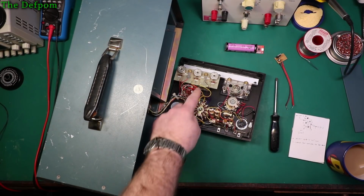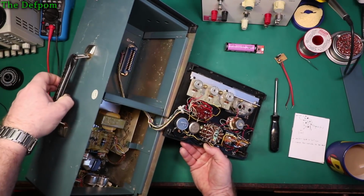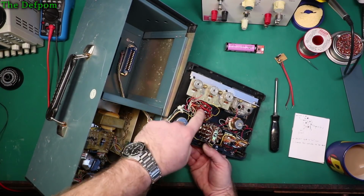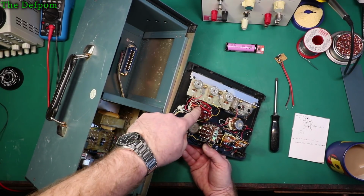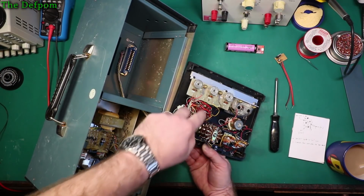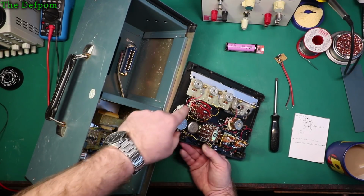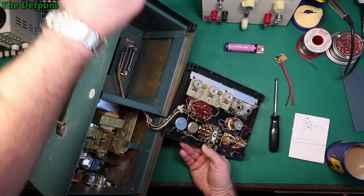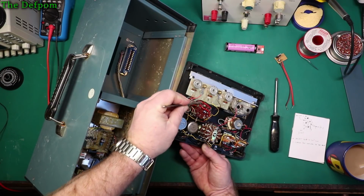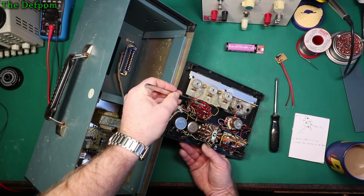So basically on the switch here, there's that wire link I had in my rough drawing there. So that terminal there is one of the test positions. It's a dual 4-way switch, right? So there's one side, there's the other side, individual poles. And when you turn to the test position, the battery connection, let's just get something to point with. So, right, there's the battery wire right there, that white and grey. That's from the battery holder directly to here. That goes onto that common terminal right there.